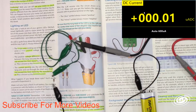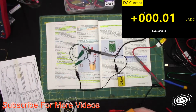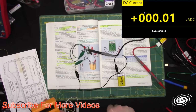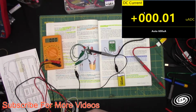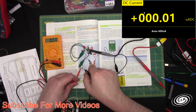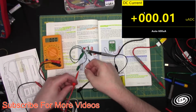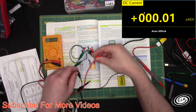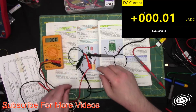Now let us bring in some cheapy meters, because I only have one good benchtop meter, but we're going to zoom out for this because we're going to bring in some cheapy meters to do some cool stuff, because I want to show you something. So we're going to come in here and we're going to go to the voltage range. Go to the 20 volt range. We're going to put that meter there so you can see it, and we're going to clip across the resistor. No, I don't want to do that. I want to clip across the diode with this one. The diode, I want to see the voltage drop across the diode. So there's the voltage drop across the diode.